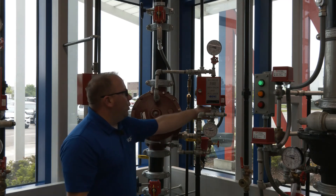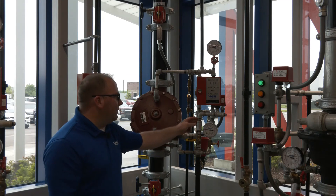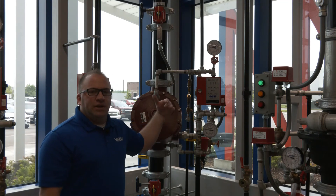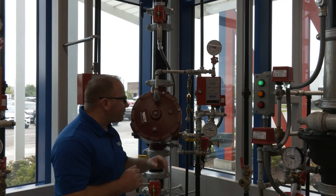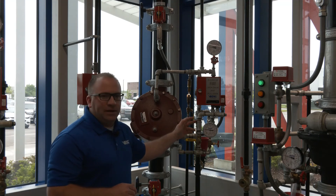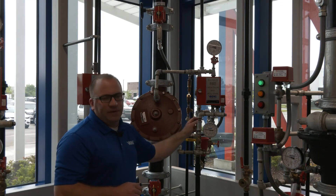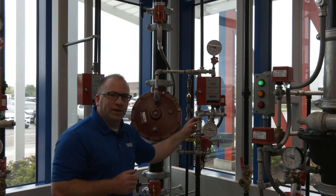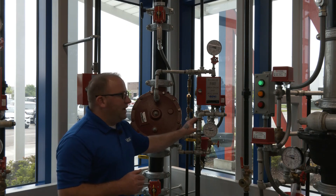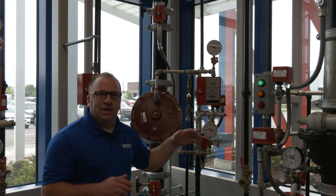You'll see that we have the alarm. When I close this valve, that water pressure is going to drain back through a drain check valve located here on the trim piping. As that pressure passes through the drain check, it'll relieve the pressure on the switch and the switch will be in the restored position. If for whatever reason we can't get the pressure off of the PS-10 switch, it's very likely caused by a piece of debris stuck in the drain check valve, not allowing that water pressure to be relieved. We can take that drain check and clean it or replace it, and that'll get our pressure off of the switch and we'll be back in business.